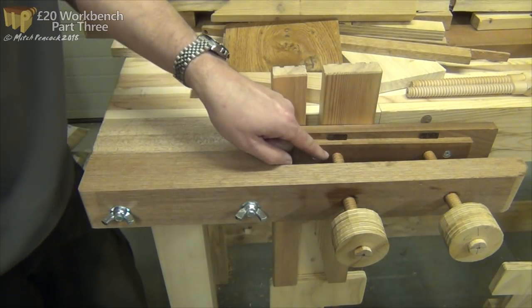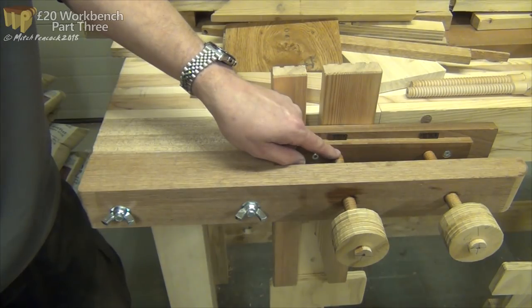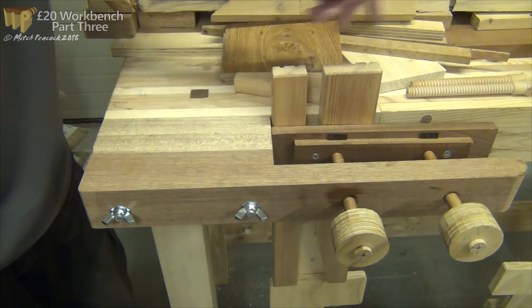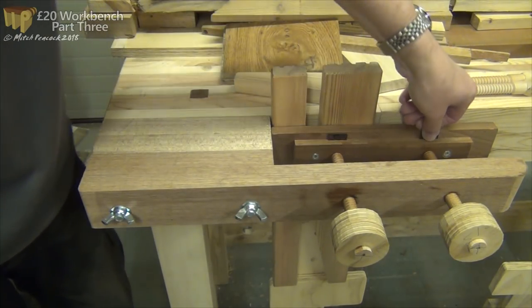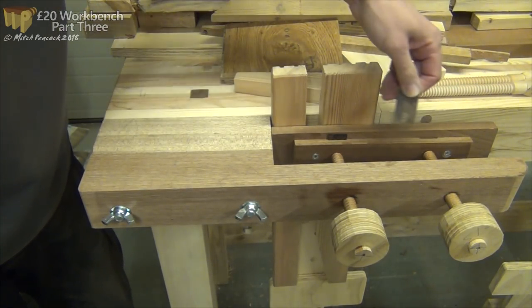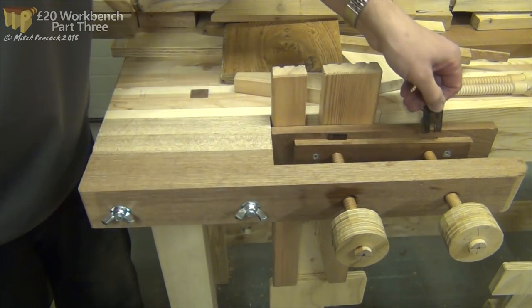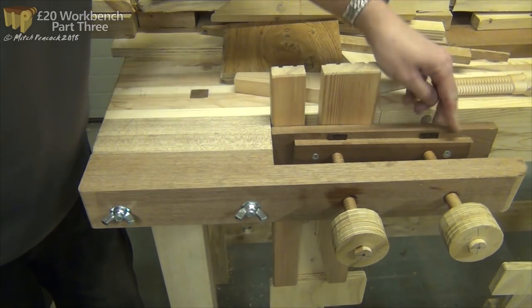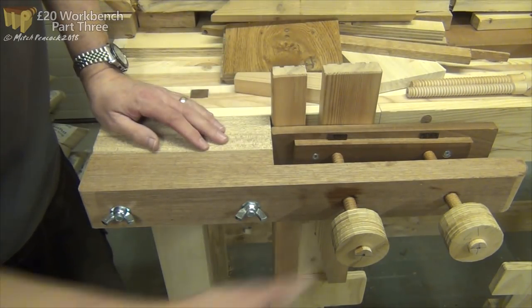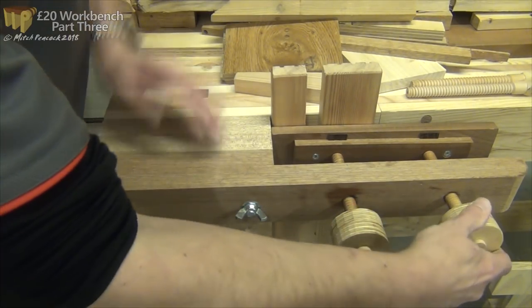Attaching the screws loosely means you just put a groove in the back of the screw itself, and then that rides within a hole and it's captured by - I'll show you here - a couple of keys in this instance. So the slot in the end of the screw just goes into that little groove there, which stops the face of the jaw falling off and allows the screw to be operated without catching on the actual jaw.